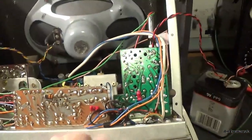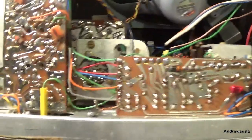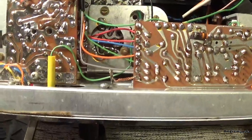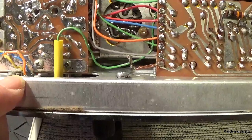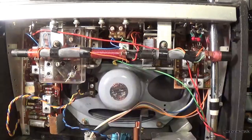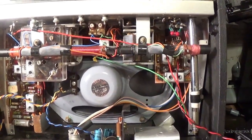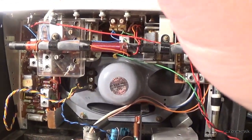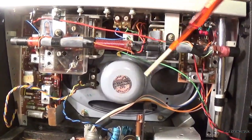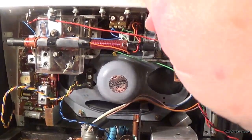Just switch it off. So that's why there was no hiss from the amp — that was all dirty, the earphone socket. The more and more I dig into this set, the more problems it seems to have. We've resolved the issue with there being no sound coming out of the speaker, or nothing being passed on from the amplifier, and that was of course the headphone socket.